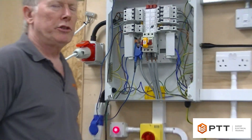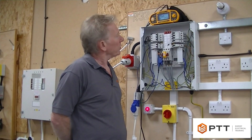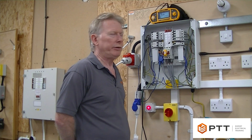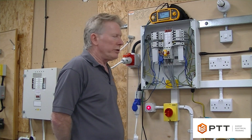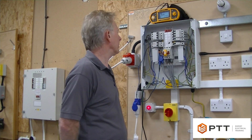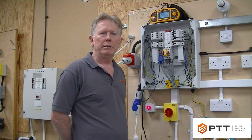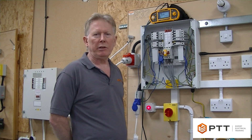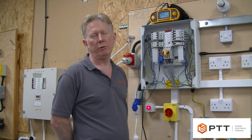I'm now going to do the prospective fault current. On three-phase we need to be aware that we're talking about 400 volts. I haven't actually got a CAT 4 meter, so I'm going to have to measure between neutral and L1, L2, and L3 consecutively. I'm also not going to do a prospective earth fault current because 230 volts can never really compete with 400 volts, so there's little point. What I'll do is take the highest single-phase reading and simply double it. Technically we would normally multiply by 1.732, which is the square root of 3, but the regulations say it's simpler to just double it — and it errs on the side of caution.